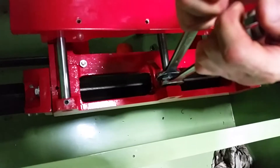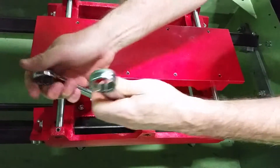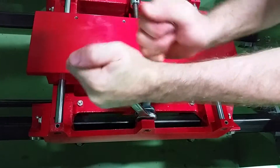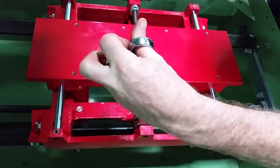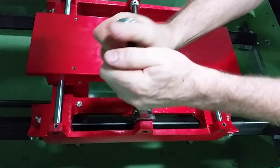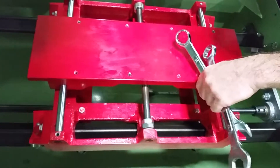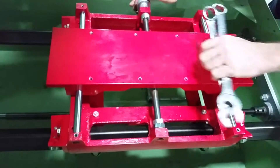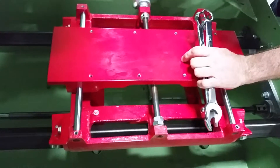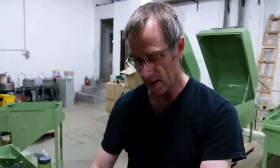I'm feeling the handle a little bit. I like a little drag because that tells me I have a good tight fit. I need a little oil on this one — it's still dry, so we'll oil it. Make sure those are tight. Now I've got a good snug crossfeed with no backlash, so I get nice straight flat slabs.